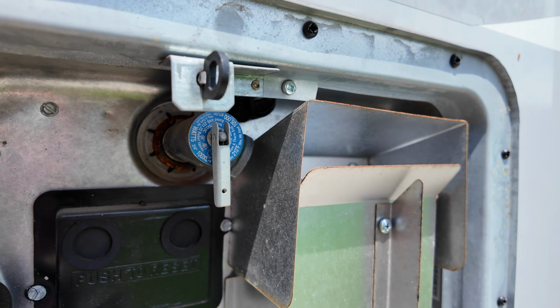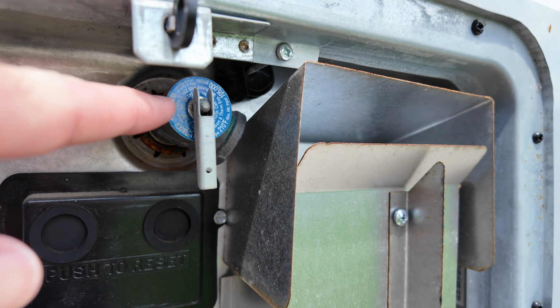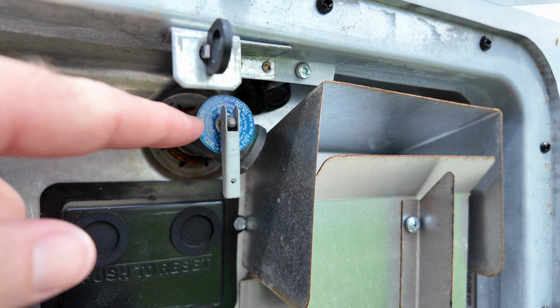When we empty our hot water heater, we generally run cold water through it. We turn it off and then run the hot water so that cold water gets pumped through it. And then once we're not getting hot water anymore in the sink, we know that it's cooled off. Or you can just wait until it cools off as well. The other thing to keep in mind that's important is the pressure release valve. Make sure you always do that first before unscrewing the anode rod so that you don't have excess pressure and have that rod come flying out at you.